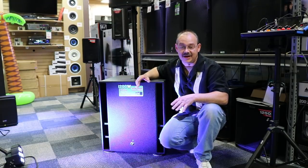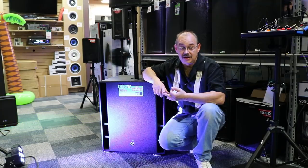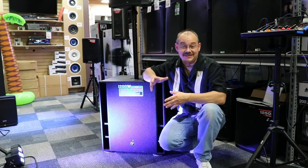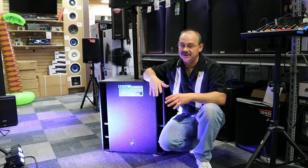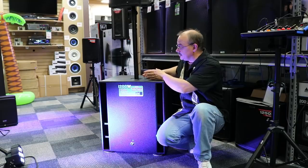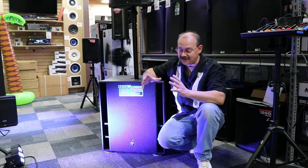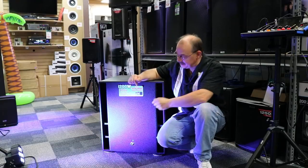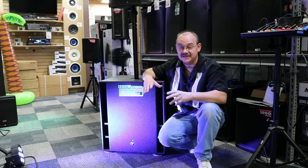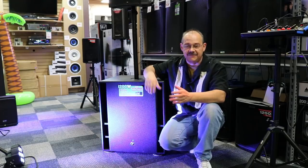This is an absolutely perfect design box whether you're going to be indoors or outdoors, in a small hall or a big hall, something with a high ceiling or a low ceiling. A bandpass means that the subwoofer is inside the actual unit — in this case flipped backwards — and it's going to give us a thundering amount of bass coming right through the box, so we're not relying on a big forward-firing system.